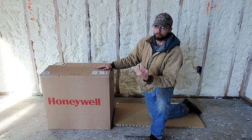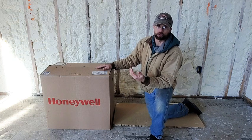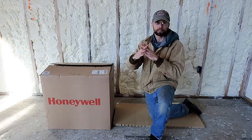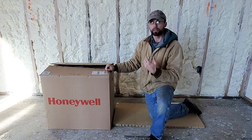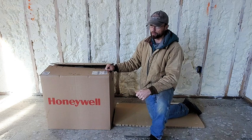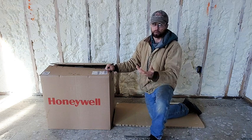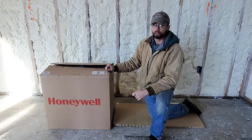If your inside temperature going out is warm and the outside temperature is cool, it will cross over some fins and transfer some of that heat, so the air coming in is conditioned to your outgoing air temperature. Same thing with the humidity - it will transfer some of the humidity to the air coming in and the air going out. An ERV is a little bit better for humidity control.